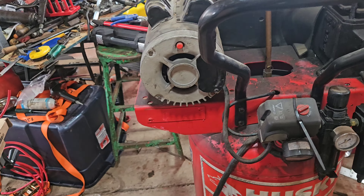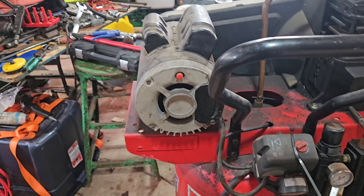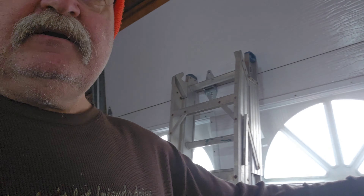We could do that - we have the technology. But don't weld them - there's a video on YouTube of one of these things blowing up. You could kill yourself if they let go. The problem is you don't have a way of knowing where the erosion has thinned it out. If it blows through a spot and leaks and you weld that, it'll just move the pressure somewhere else and you get an even bigger blowout - that's when you get an explosion. That video online - it lifted the workbench up, ripped apart the overhead roll-up door. Not good.